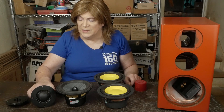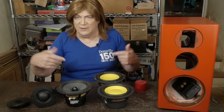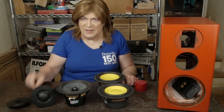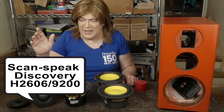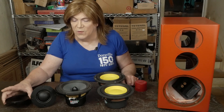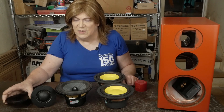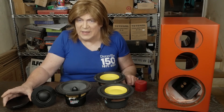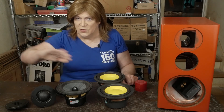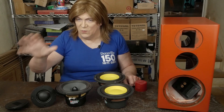These speakers have a cool dome midrange with a sealed back, and they come with a little ribbon tweeter that I'm not sure I'm a huge fan of. I've got a soft dome tweeter in a little horn on the way — arriving tomorrow — and the same company also makes a plain soft dome tweeter not in a horn. They both have the same 104-millimeter diameter, making it fairly easy to swap drivers and compare: ribbon tweeter, horn-loaded soft dome, and traditional surface-mounted soft dome.